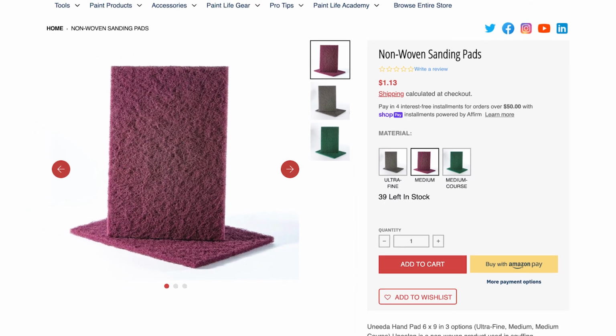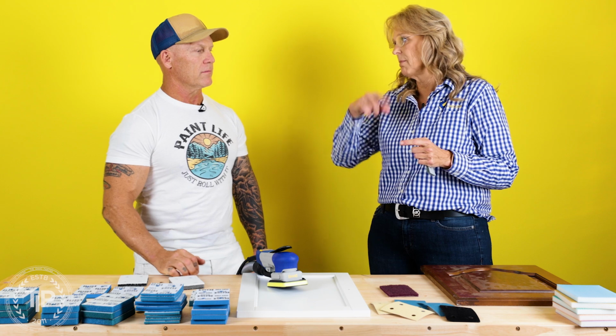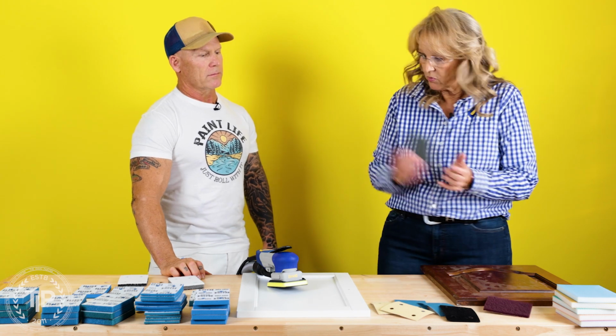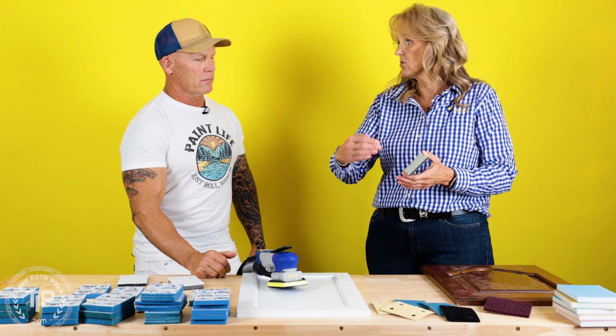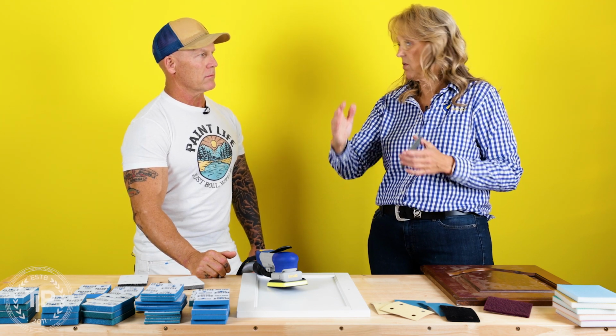The only reason I use the 320 grit is if someone has really swirled something up with a 5-inch and we've got some major pigtails going on. I need something a little more aggressive, so then we'll use the maroon. Day to day, I use the gray. This is where someone has used the 3x4 in the center panel and it's caught and swirled up a little bit. We can use the gray over it on the raw wood and it'll eliminate, or mask, the swirls. It really knocks the tops off of them so that you don't see them in stain.